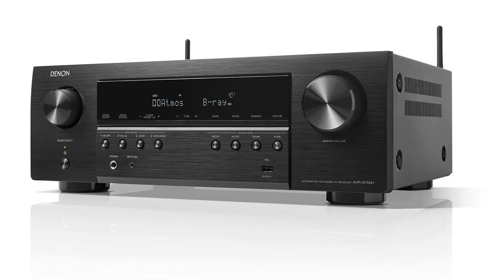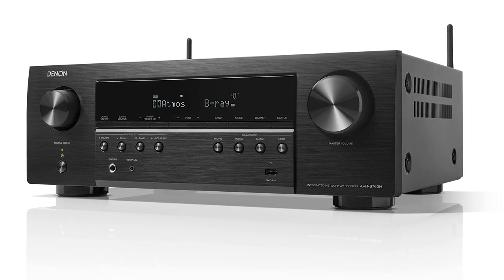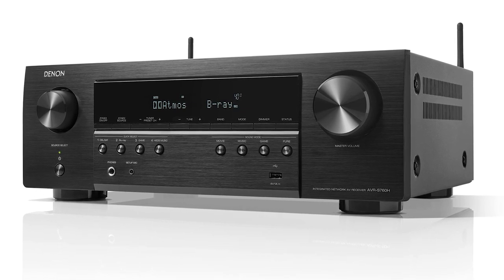How many speakers will you be connecting to the new amplifier? Depending on whether you'll be setting up a home theater or just a simple two-channel listening environment, most basic home theaters will run five speakers and a subwoofer to recreate a theater-like environment and provide a full range experience. In that case, you will need to buy an audio video receiver, or AVR. An AVR has many functions and features that will consolidate your entertainment needs into one device. If you have a TV, media streamer, Blu-ray player, and gaming machine, most new AVRs will allow you to connect them via HDMI cable.